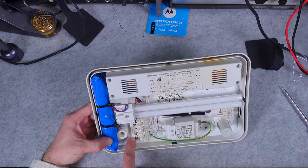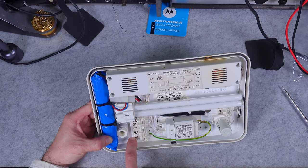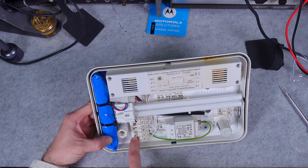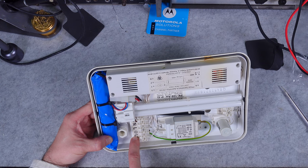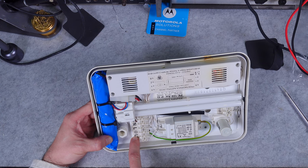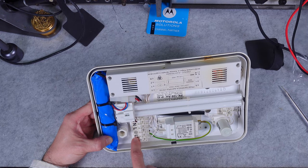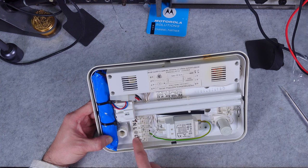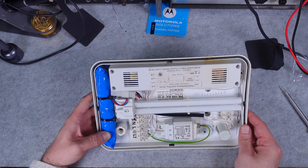In comparison, L1 is another live, but that one is for normal mode of operation and can be controlled on or off. The always-on live must be present all the time — it won't trigger emergency mode. L1 can be switched by a switch. So let's try to wire it.